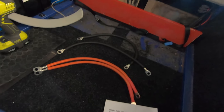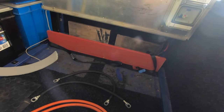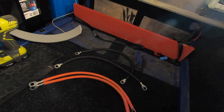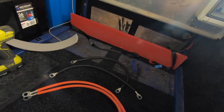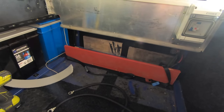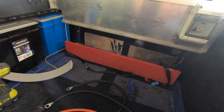I made up the cords. Now I kept all my leads the same lengths. They're going to fuses that haven't got anything on them. So there's not going to be any loads or anything on these batteries or the wires when I put them in. And I'm going to be really really careful because this whole trailer frame is grounded to the neutral and to the negative on the 12 volt side. It does that for the lights and the water pumps and all that sort of stuff.